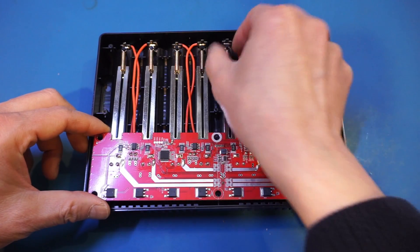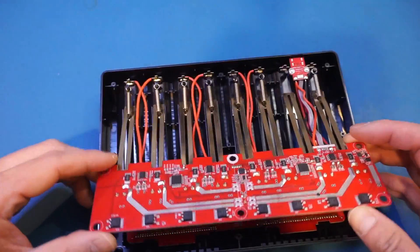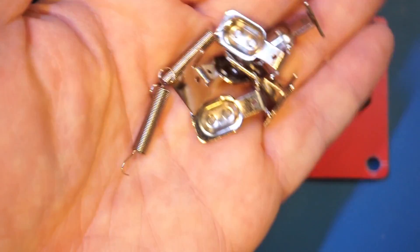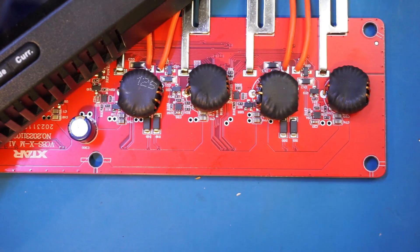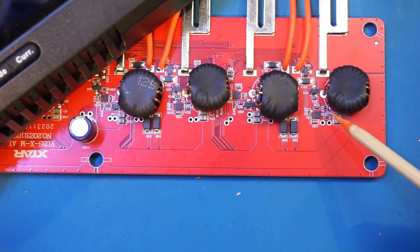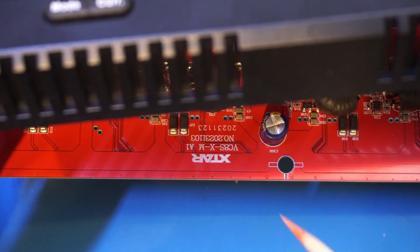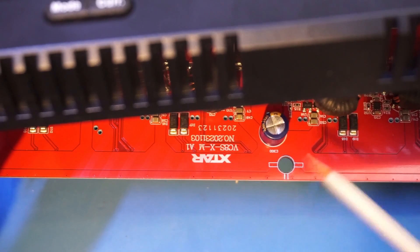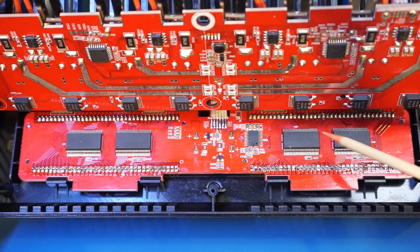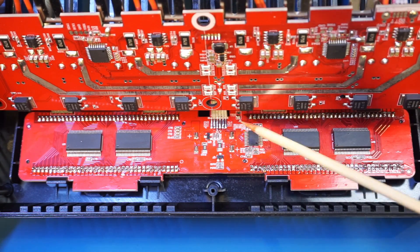This whole tab seems to be connected. After removing the spring holders and wiggling it out, all the parts fell out — I'll have to reassemble them later. On each channel we have an inductor with some circuitry around it, presumably for charging. The chip marked BD2L00 — I cannot find any information about it, but presumably it's controlling the charging circuitry. From the silk screen on the PCB, you can see this was made by X-Star along with PCB revision information. Here's a peek at the LCD board at the bottom — we have two LCDs, one on each side. The chip markings are also etched off, but the connection is done via pins, so this is clearly a serial-based protocol.